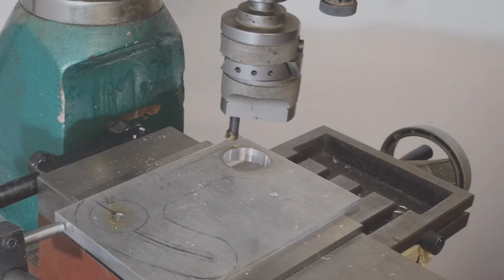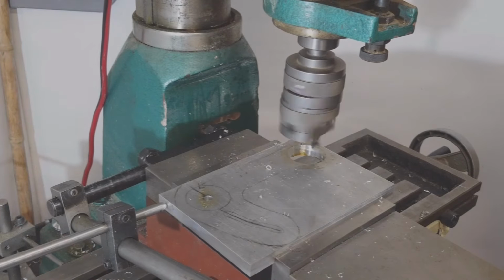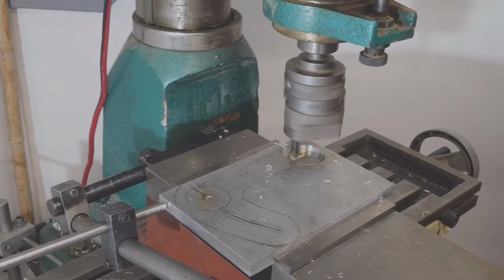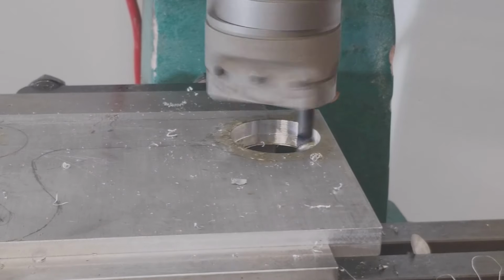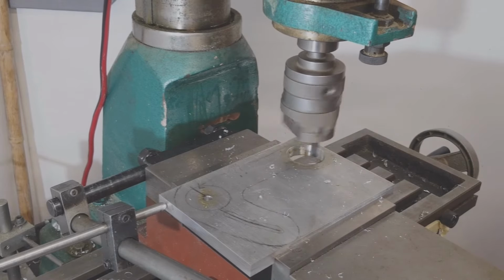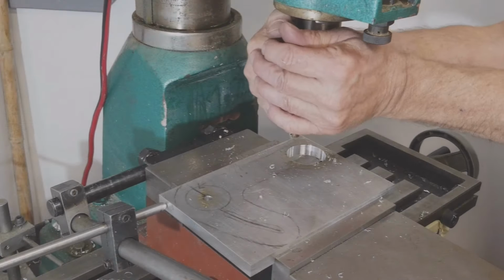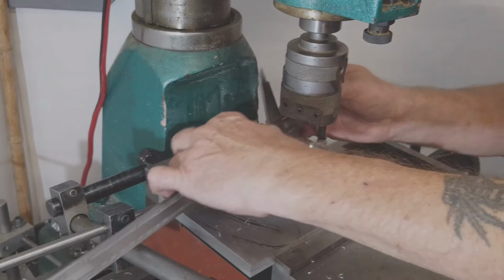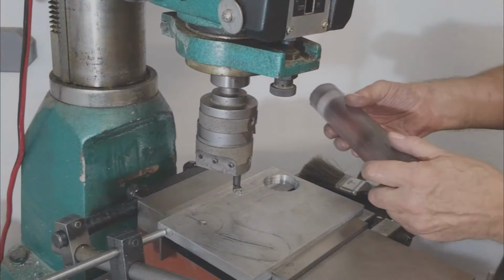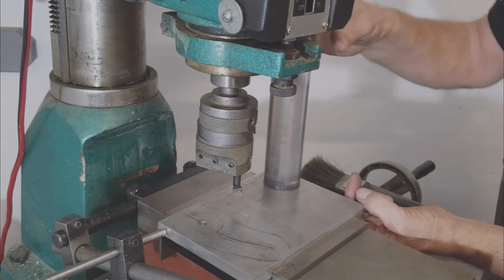It looks like it goes by diameter. If I dial 50 thousandths, 50 thousandths comes off the diameter. That's what I'm going to stick with, 50. 1.762. All right, this is my gauge. And this has to go through. And it does.